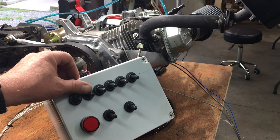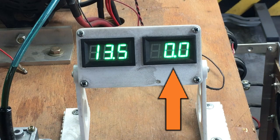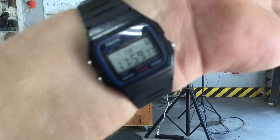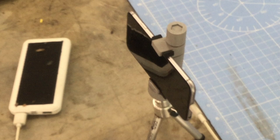All the upper switches engage all the load resistors. Now these switches don't directly turn anything on — they merely switch the high power relays on and off. When the loads are engaged, we'll be able to see the amps displayed on the meter. Now this engine's equipped with a bunch of thermocouples. We have one on the exhaust, another measures the crankcase oil temperature, and there's even one under the spark plug to measure cylinder head temperature. So it's 11:59 on a Sunday morning. Let's fire this rig up and start collecting data. But before we do that, let's take a look at the instruments. This is the cube of knowledge — it's actually a plastic cube with instruments Velcroed to it. And right here we have an iPhone that will be recording the cube of knowledge so we can capture the video of all the instruments.